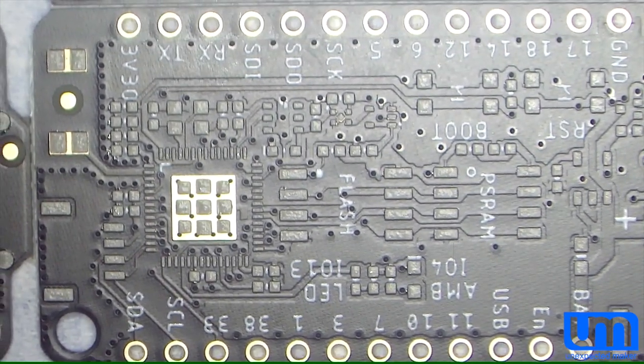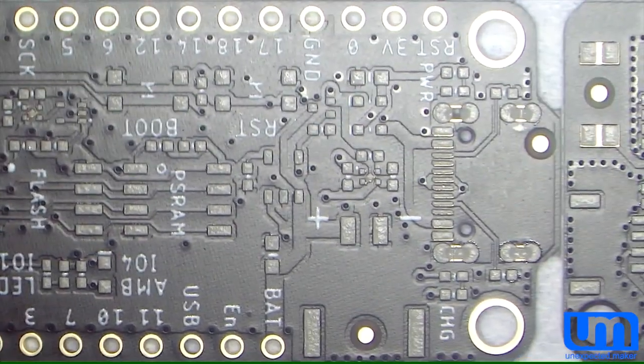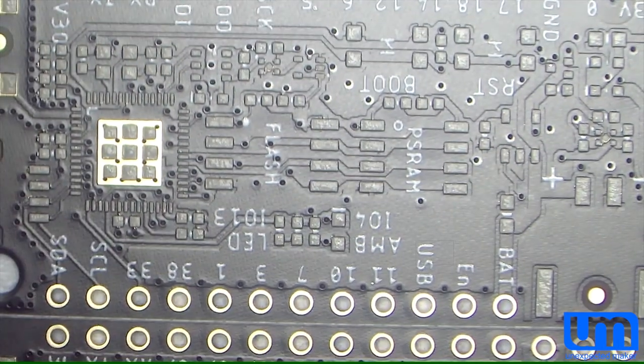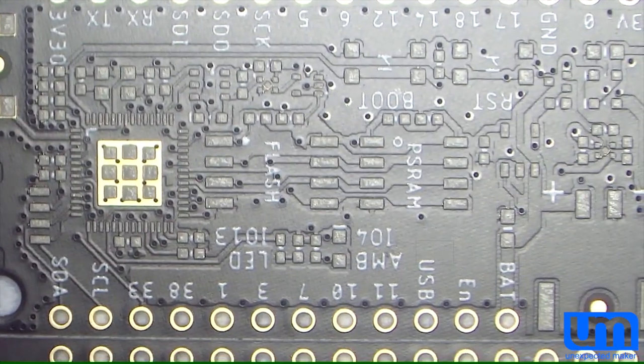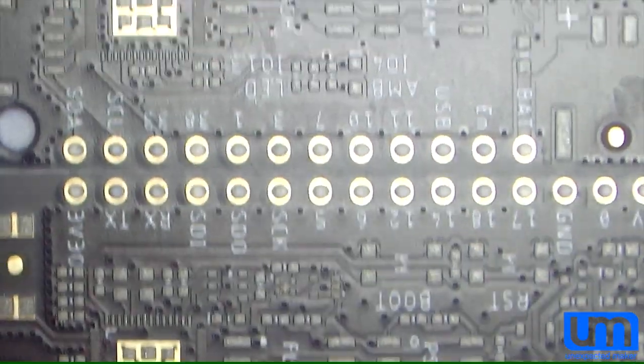This is sitting on just some tissue so I can move it around without touching the actual PCB. Look at it — it's honestly incredible. This is the reliability and consistency I'm getting out of my stencil printer with my vacuum bed and just a $49 vacuum cleaner. I would challenge a $30,000 stencil printing machine to do any better than this. Sure, it's a manual process, it's not automated, but part of the issue with a manual process is the fear of not knowing if it's going to turn out right — whereas with an automatic process you set it once and get repeatability. But with this, I've got 100% repeatability. I've run 60 or 70 panels of different boards through it — probably close to a thousand PCBs — and I've had perfect pasting on every single one. My mind is blown.